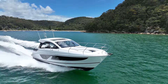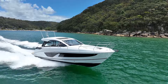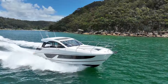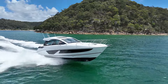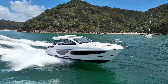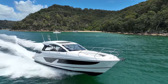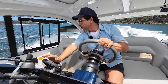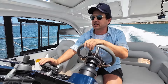I'm now entering a wave zone, so I'm not going to go faster just yet — I'll maintain this speed. I suggest you do the same when driving out of protected waters into an exposed part of the ocean where there could be waves conflicting with tide and things could get tricky. Always enter at a conservative speed, and if not sure, go slower — back it down to around 23 knots until you can feel the sea state, and once again prepare your guests. Turning into the waves — this feels really good. If entering a really wavy zone, you might choose to drive with single lever mode so you can rest your palm and have ultimate control of the throttles.